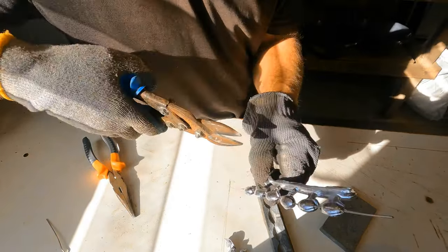All right, that's all nearly remelted. What I like to do, what I didn't show you, you've got to be careful though, is angle that so the spout starts to get a bit hotter as well. So that's the first place it freezes when you're pouring. Looking alright. I reckon I'll be able to get them done. Then we'll melt some more lead and do the star sinkers. Now here we go.